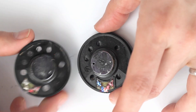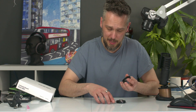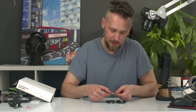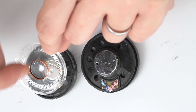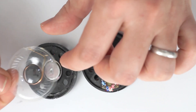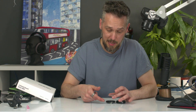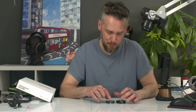This one we've pulled apart. We've got the magnet on the back here, and you've got a voice coil — so you've got a stationary magnet, and attached to this diaphragm we've got a voice coil, which is essentially an electromagnet. As the signal comes in, it forms a magnetic field which pushes against the magnet, and then moves this diaphragm in and out, and the diaphragm essentially pushes the air in and out.